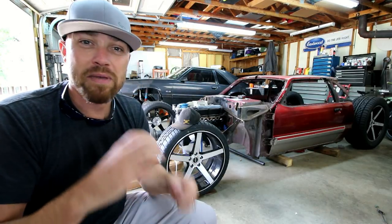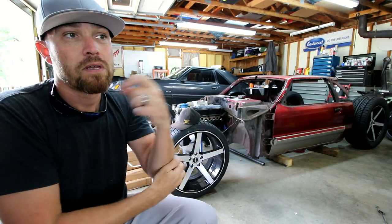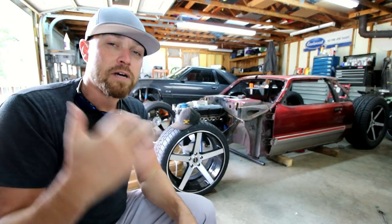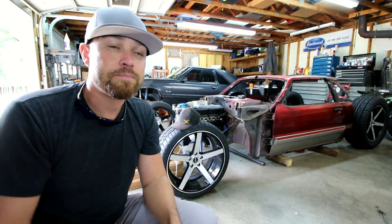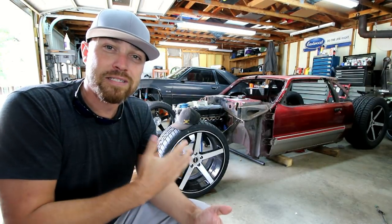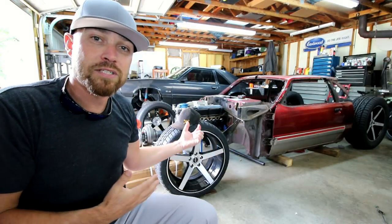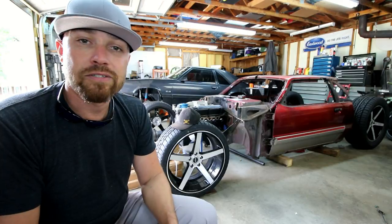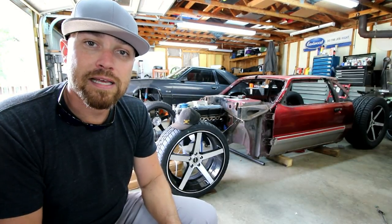May not do anything, may just go back straight pipe and just dump it right before the axle. Later on, I may do some experimental stuff with some mufflers, may make an aluminum muffler. I've done that in the past and they actually work really well. I know a lot of you guys were concerned about the aluminum. I've used the aluminum on exhaust on turbo cars before. Didn't have any problems. That doesn't mean that I won't on this one. But if I do, I'll just go back later on and do a stainless back half or titanium back half or something like that.